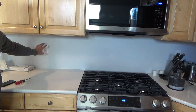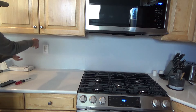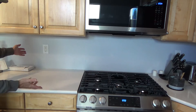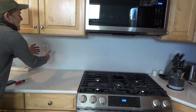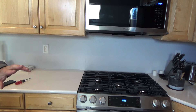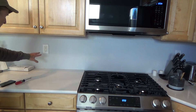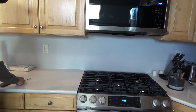When I get ready to do the backsplash, all the electrical is there. What I'm gonna have to do is — if I was going to save all these electrical outlets — pull them out of the wall, tip them sideways, and push them back in the box even with the wires still on there. I can leave the breakers off and put tiles on even with the outlets still there. But if I'm removing all of them, I'd remove the wires, let the wire stick out, put wire nuts on them, and when I reinstall everything, put in the 20-amp duplex receptacles and the 20-amp GFIs.